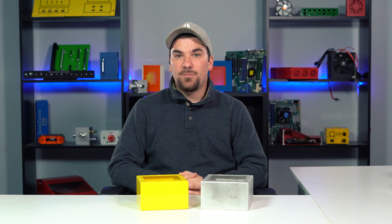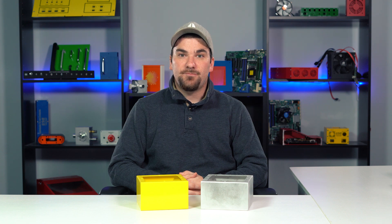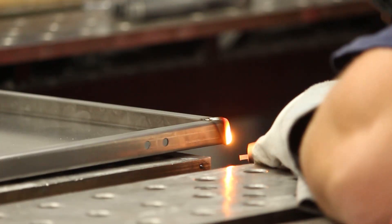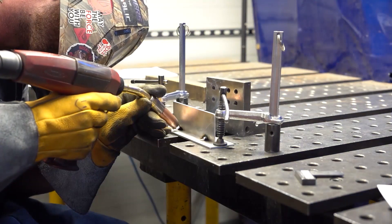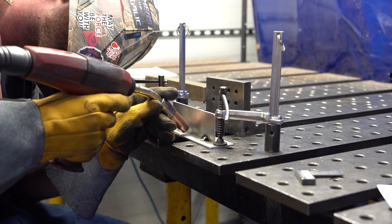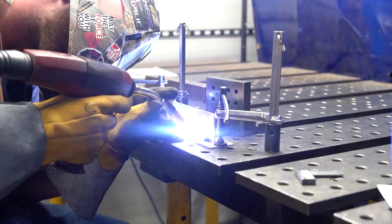In the pulsing current phase, the welding droplets are detached in a targeted manner via a precisely dosed current pulse. Because of this process, the arc only introduces heat for a very brief period during the arc burning phase. The arc length is detected and adjusted mechanically. The arc remains stable no matter what the surface of the workpiece is like or how fast the user welds, meaning CMT can be used everywhere and in every position.